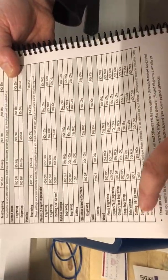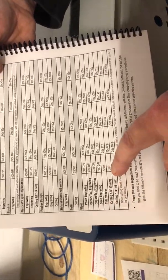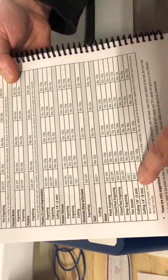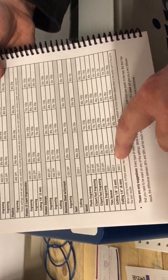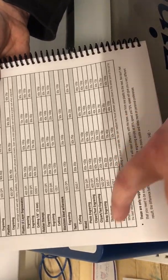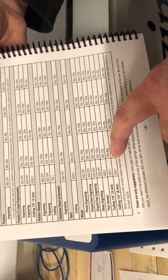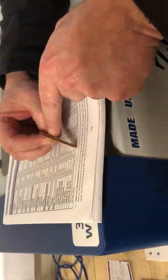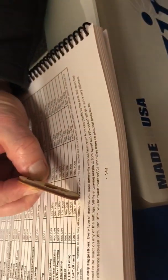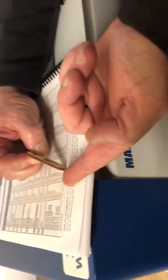But if we want to cut through, now the thickness of the material becomes important. Yeah? So that was 3mm plywood. So using a frequency of 500, a speed of 70%, and a power of 60%. I actually found that didn't cut it all the way through, and I increased the power to 100, and that cut it through fine. You can tell on the edge of this, really, this sort of nice toasted golden brown. If it was excessive power, this would be black, charred, and it would actually leave like a sooty mark on your finger. Okay.